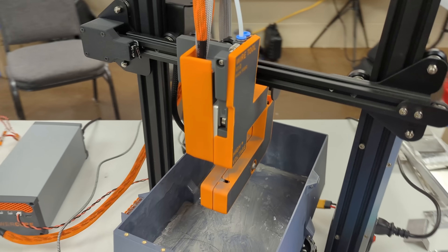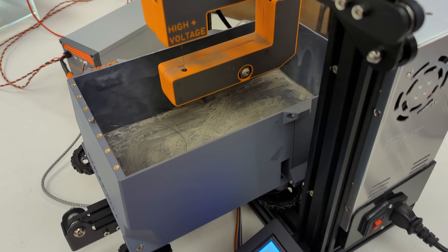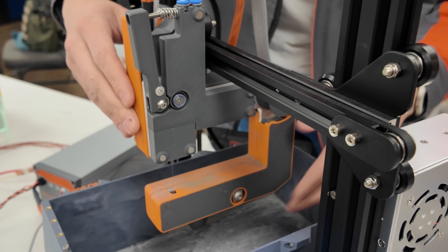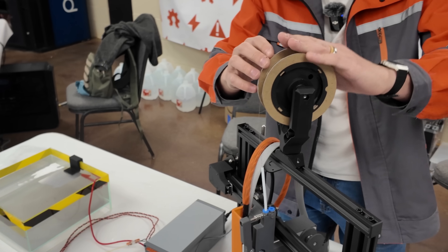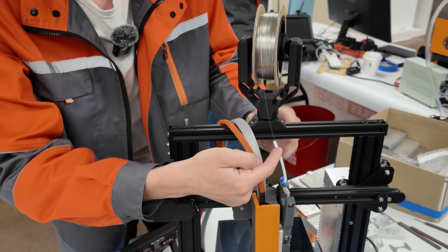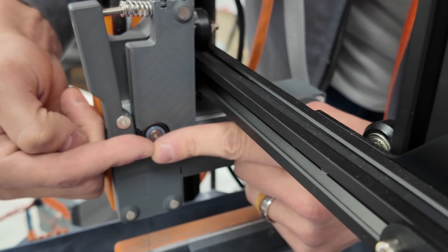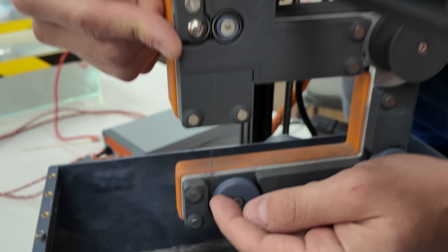That's why we made the wire tool. It's about the same price as a premium hotend for your 3D printer, and it'll work on any 24-volt printer. This is all going to be open source hardware too. We've got our wire supply here at the top — you're going to be able to get these in quarter kilogram spools. The wire comes down, goes through this bowden tube here, down to the tensioner where two roller bearings pinch the wire, then through a ceramic wire guide, and down to these idlers.